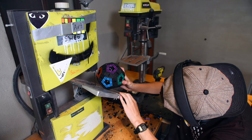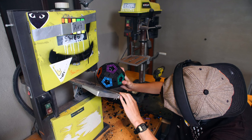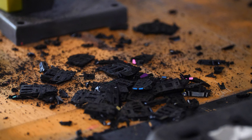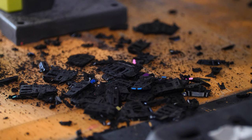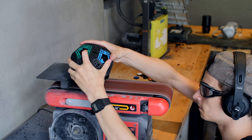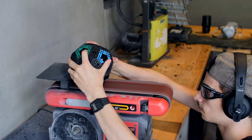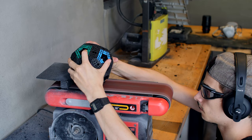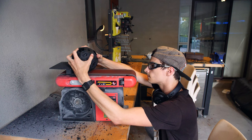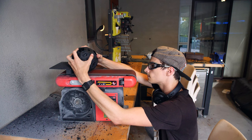This was the problem I was dealing with — I could start a cut off pretty well, but eventually part of the puzzle would hit part of the bandsaw and I'd have to stop. After finishing all the initial cuts, I began cutting the puzzle to its final depth. This was so dangerous and nerve-wracking I don't want to show the actual cuts, but after every few cuts I took the puzzle to my belt sander to sand those faces flat. I was using those faces to guide further cuts and didn't want errors to compound, so every few cuts I made sure everything was up to the correct dimension. This took all day just to cut the puzzle to its final shape, but I'm really happy with how it turned out. After all pieces were cut and sanded — behold, all of the cuts are done.